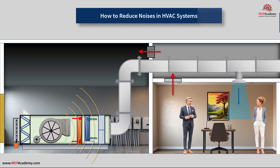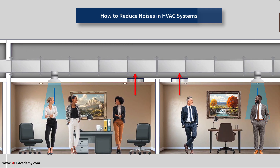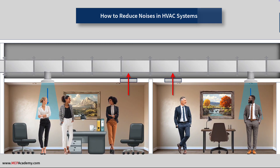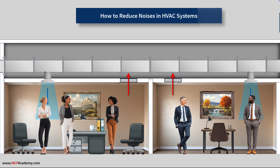Let's start with the sounds from a neighboring office space. If you reside in a large office building where the return air system is unducted, then each office has a return air grill that allows the air from the space to return to the air handler through the ceiling plenum, which is shared by all the other offices. If you're hearing the individual in the adjacent office, then the sound can be traveling in multiple paths to your ears — one could be that the walls are uninsulated and sound is reverberating through the walls, the other could be that unducted return air grill.